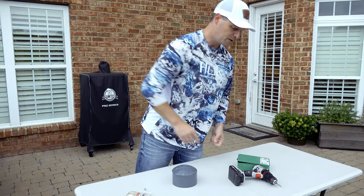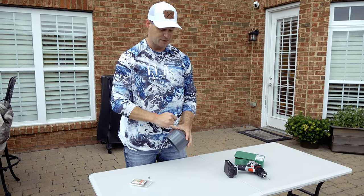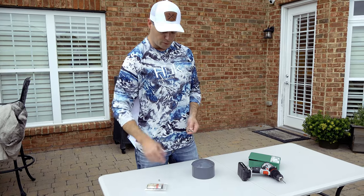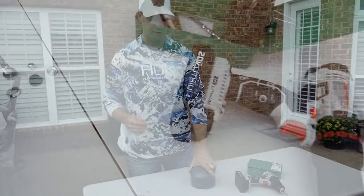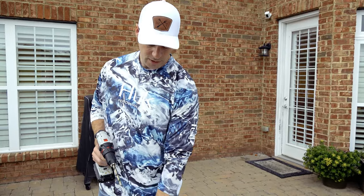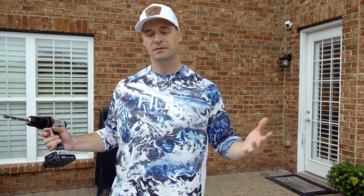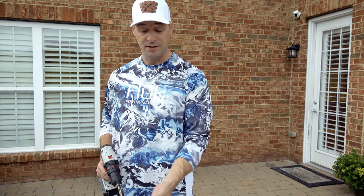One other improvement: based on comments and suggestions from viewers for Bait Cannon 2.0, we're going to switch from a bicycle tire rubber valve to something more substantial — metal clamp-in valves, same diameter at 0.453 inches. We're going to drill a hole and tap it into the end cap that's the very end of our air cylinder, then install the air valve. This is how we pump pressurized air into the air tank. It needs to fit very tight, so I'm going to start with a smaller drill bit and step up, making sure this new valve still fits tight — because you do not want air leaking around this at all.